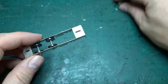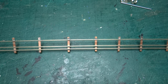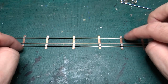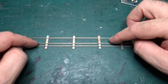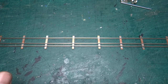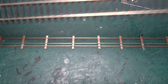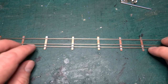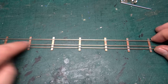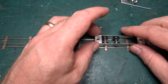For those new to the channel, this is a piece of hand-built dual gauge track. The outer two rails are set to 14mm gauge, and the middle rail plus the outermost rail on the other side are set to 9mm gauge. That lets me test most of the small models I build. There was no available 14mm gauge track when I started, so I had to build a test piece, and adding a third rail for 9mm gauge gave me a nice long piece.